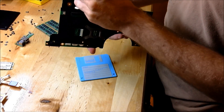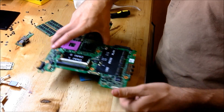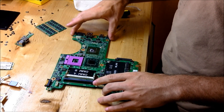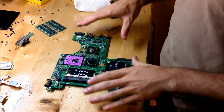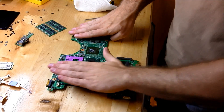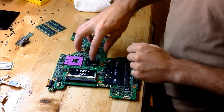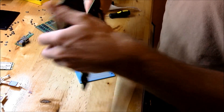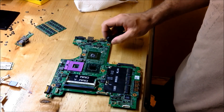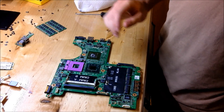It's also a good idea to remove all the stickers on the motherboard. It will make a big mess if you don't remove all the stickers that you can. Then what you want to do is wrap the rest of the board in aluminum foil - cover the various sections and the CPU socket, just wrap it all around and leave the graphics section exposed. That way you don't risk damaging any of the other parts. These capacitors can pop, which would obviously destroy your board.